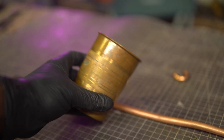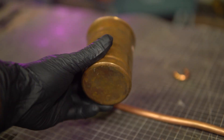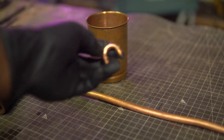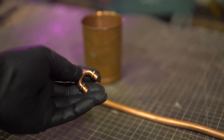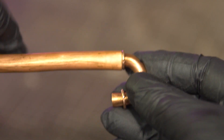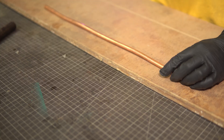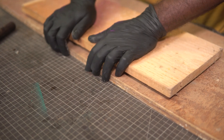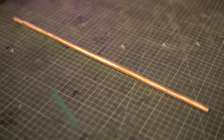Here I made one with materials available to me, but the concept is similar. I found the method of making this quite fast and efficient. We need a foot or so of copper pipe usually used in air conditioning. For the cup, I'm using a copper tumbler, mainly because it is easy to braze using just a blowtorch and it is not too expensive. And a U-bend, readily available at refrigeration stores — it comes with a ring on top which acts like a stopper, but when heated, it melts and welds forming a firm airtight joint. The copper pipe may not be straight, and the easy way I found to straighten it is sandwiching it between two pieces of plywood and rolling it with a little pressure, like I would roll chapati dough.